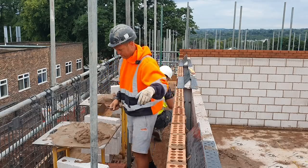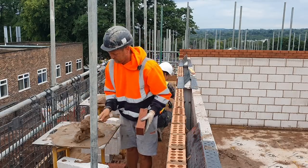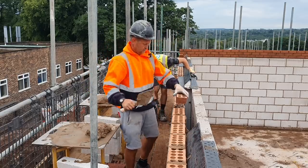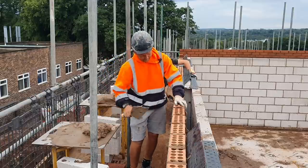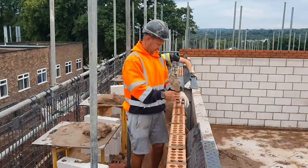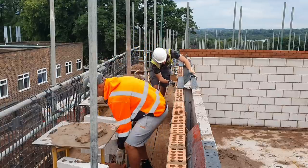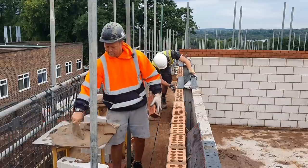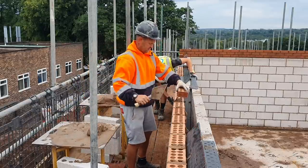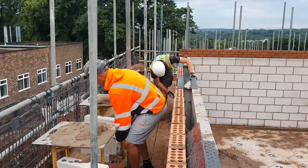This is not bad either because it ties all this top pillar together with these lintels, which is better, I would say. Because normally you just finish up with an eaves lintel. Eaves lintel doesn't carry brickwork, it's just this thin. And then these middle pillars are only tied together with wall plate, which is a bit not as strong, let's put it that way. Nice detail, one course of brick over. And that's what I'm seeing.